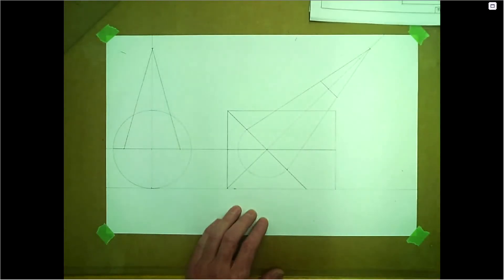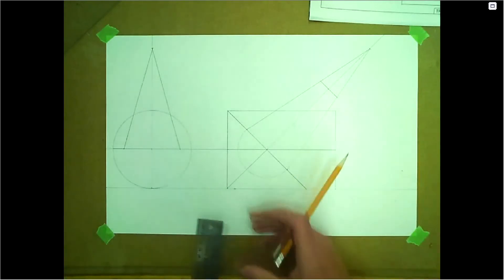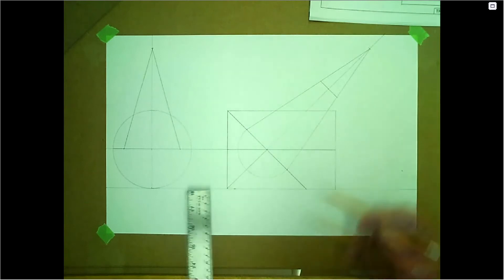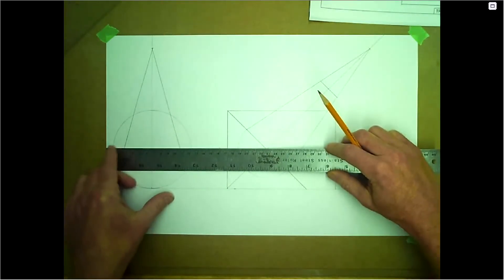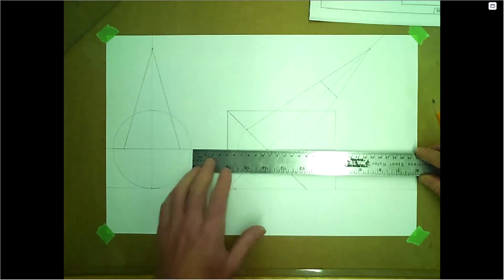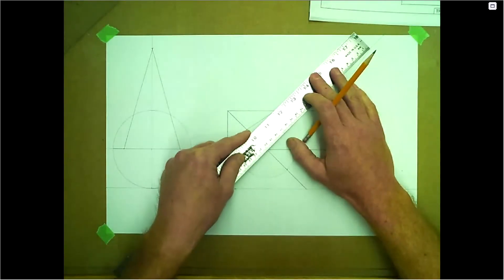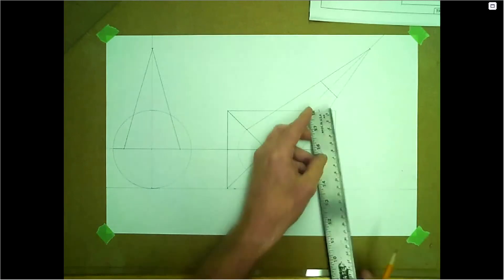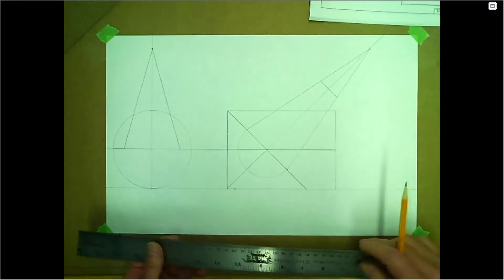Let's double check to see what's happening over here at the drawing. I've brought this up so we can allow enough room to put a whole pattern down below. We've gone 65 millimeters up just to allow a whole pattern to fit right there. We're about 20 mils below the top, and 10 mil from the edge for this cylinder. We're 50 mil in between our views. Our cone here is 80 at the base, 200 for the height or length. We're 150 and 110 — just double checking dimensions. The biggest thing is just avoiding mistakes. I think we've double checked all the dimensions and we're ready to go.